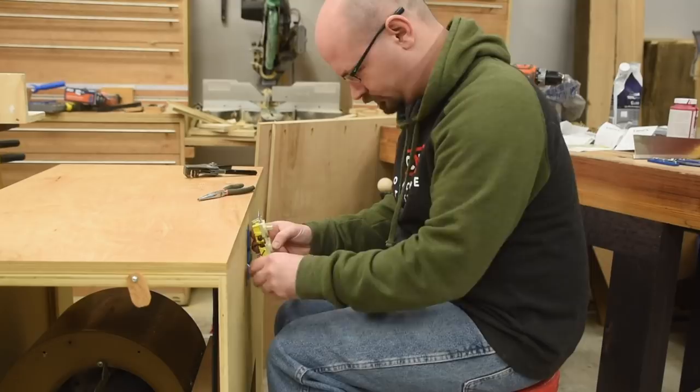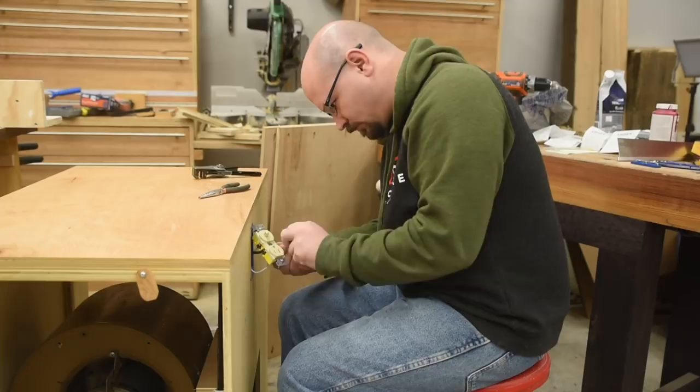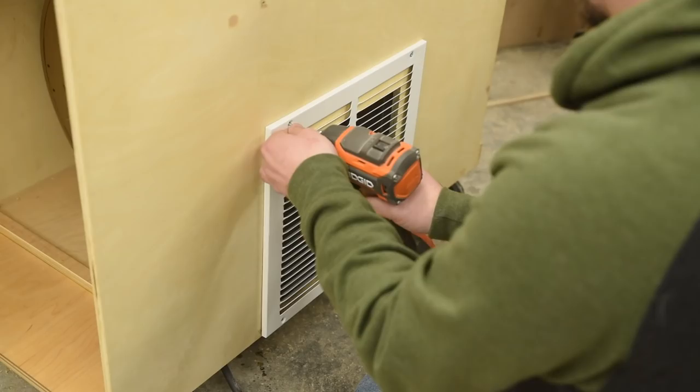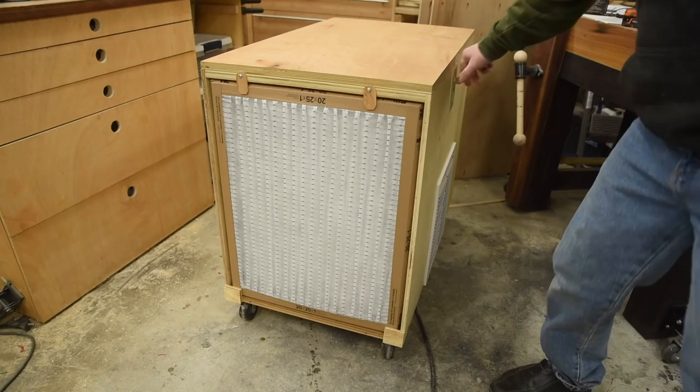The wiring is set up so that the outlet is always live for the planer to be plugged into, and the switch only controls the blower — not so both can run at the same time, as that'd probably be too much load, but just to save on how many cords get pulled around. I added a cover to the exhaust to keep debris out of the blower motor and also to deflect the air up so it doesn't stir dust on the ground. Last I installed the filters, gave it a try, and it was surprisingly quieter than I expected. Then it was time to take it to Andrew's shop.